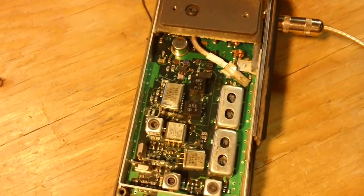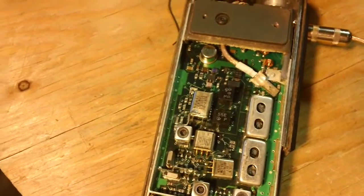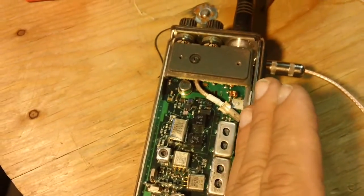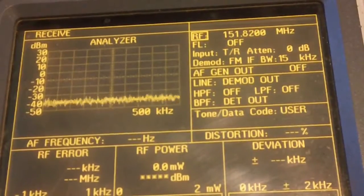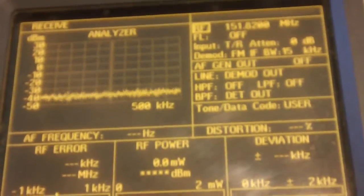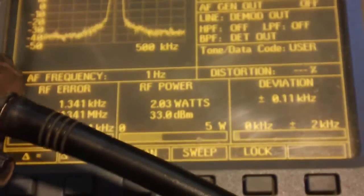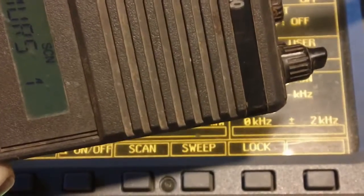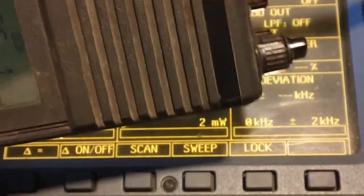By the way, I was tuning at 144 MHz, so everything from 144 up to about 165 MHz should be within specs. You'll lose some top end because we shifted the reference from higher to lower to accommodate the ham frequencies — that's the nature of the game. This one goes out to the FCC. On the MURS channel, tuned to 151.820 MHz — MURS channel one — I'm not supposed to exceed two watts. I'm transmitting two watts on the dot. Unfortunately, two watts applies to all bands, including amateur. I can't control that; that's what it has to be to stay street legal. This radio is now street legal, tuned, and ready to go for disaster preparedness.